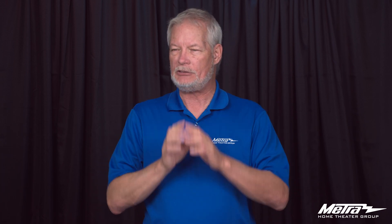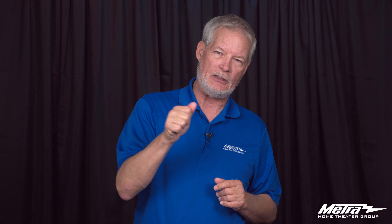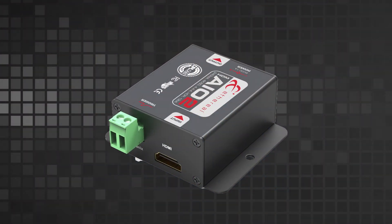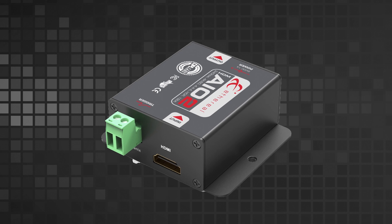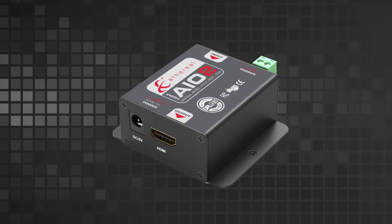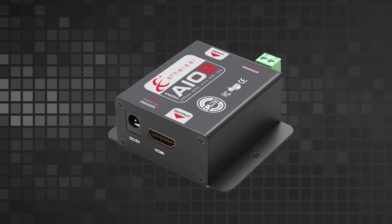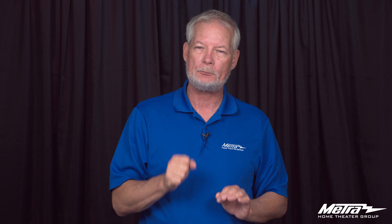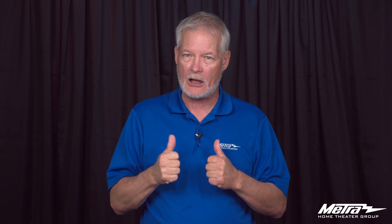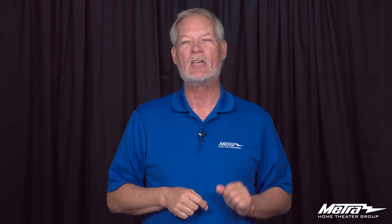The AIO2 builds on our original AIO. It gives you a phenomenally small form factor, is easy to install, and fixes your EDID problems — particularly issues with media servers that don't always work well with displays and AVRs. It also supports power and voltage down the TMDS feeds in case the source output is a little weak, and boosts five-volt and hot plug voltage and current to make sure they're solid.